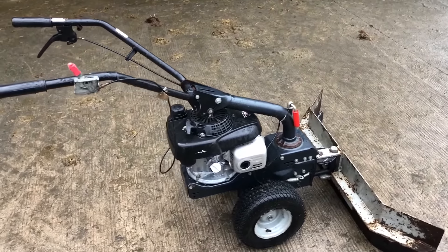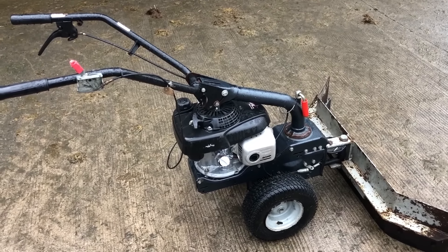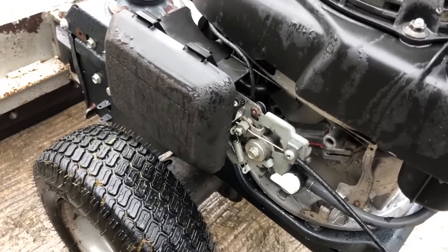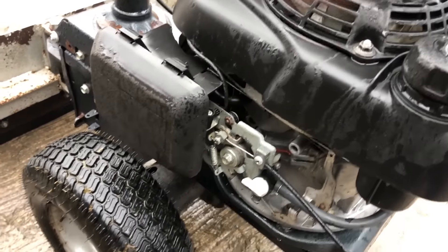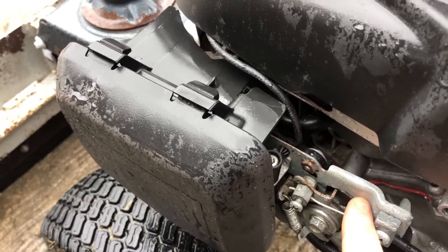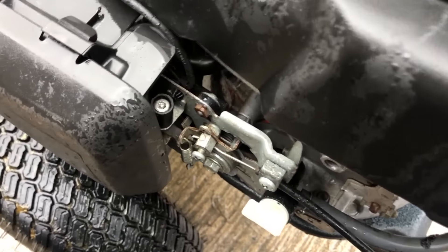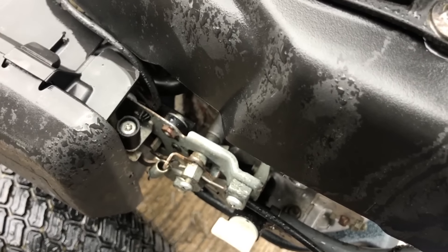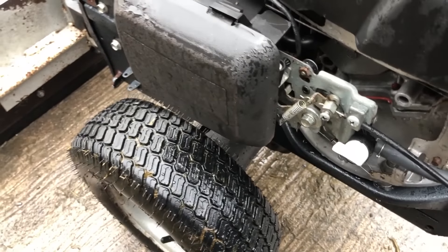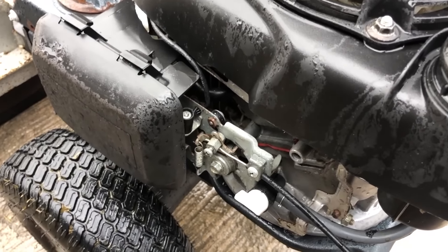Now we get to the engine — this has been a troublesome engine. It's the Honda engine that comes on even the newest ones you buy today. The throttle mechanism that comes with it has a lock nut that rubs against a piece of steel as it moves back and forth, pushing the choke out no matter how much you try to fix it. We tried loads of different techniques and could never sort it. To start it, you have to push the choke up and hold a finger on that piece to give it a little lift — then she starts first time. It's a fiddly thing and it's really badly put together.